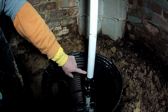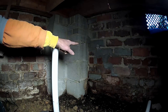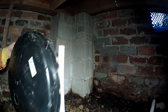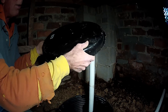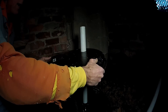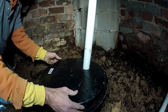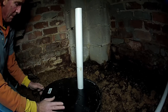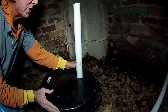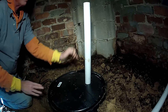From the pump, the water rises up, comes through the check valve, through the riser up, and then it's going to turn and go right through that wall. Now we're going to put our lid on — I've already drilled a 2-inch hole for our inch and a half pipe. It slides right on top and pretty much just locks down in place. Now our pump's ready to be plugged in.